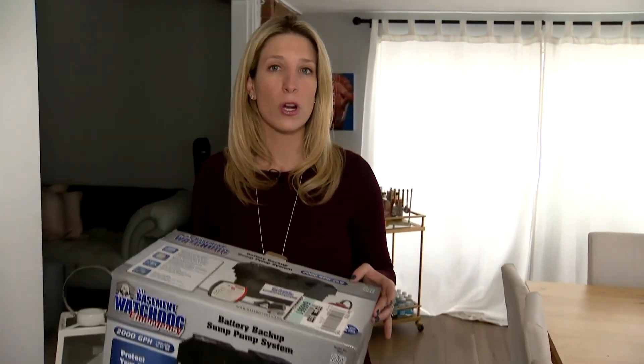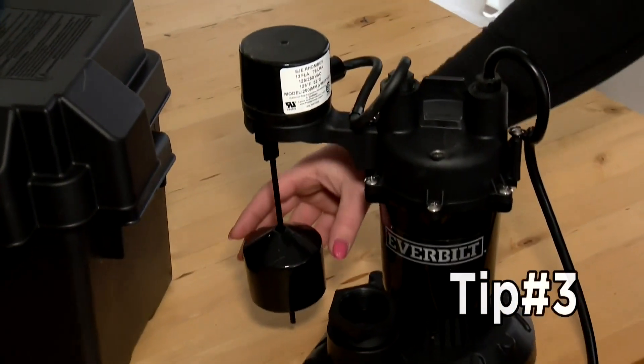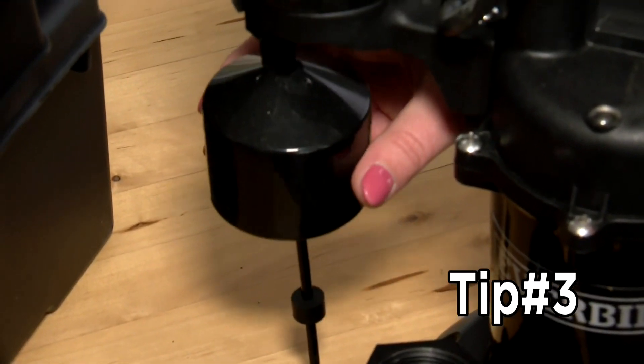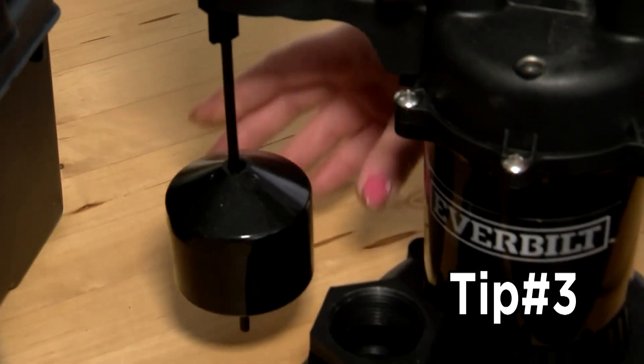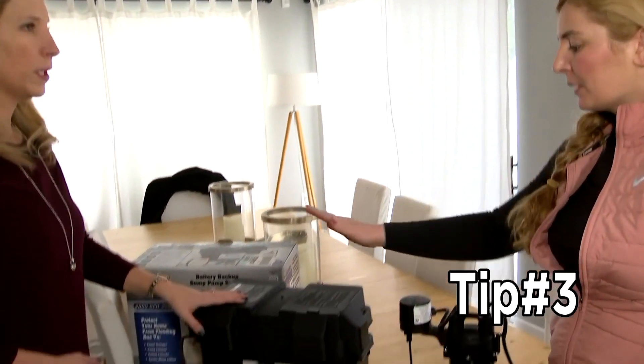Our final tip to make sure your house is dry is to buy an insurance policy of sorts. Jessica Lawton of Techna House Inspection says first, make sure your sump pump works. This is a pretty standard model — a lot of them have a float similar to this. You're just going to lift the float, which should trigger the pump to come on. You hear the click? It'll pump that water out and away and outside your house. So first things first, make sure it's working — this is your primary pump.